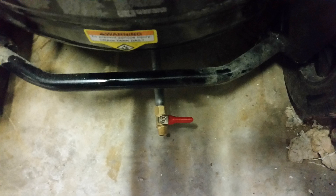Not pictured is my assembly of the street elbow onto the compressor tank. I simply drained the tank, removed the old valve, applied thread sealant to the male threads on the street elbow, installed the elbow onto the tank making sure it was tight and facing the back of the tank. At that point, I assembled the nipples onto the coupler, and assembled the dump valve onto the nipple. Then the one remaining end I applied pipe sealant to, installed onto the elbow, and snugged it all down with a pipe wrench.